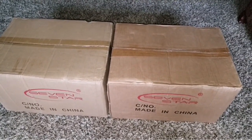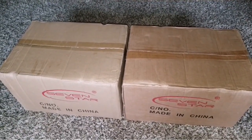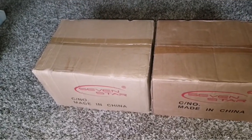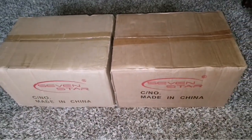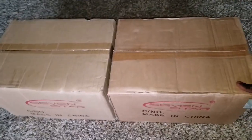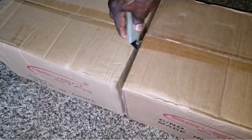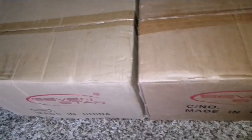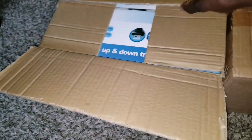Because the PIPs — we don't have any of the bigger PIPs like four or five kilowatt; they're all 2.4 kilowatt. So I had to go through MPP Solar and get the 5 kilowatt units — two of them, which is 10 kilowatts. They're already configured for parallel, so they can be a 10 kilowatt system. These transformers are 5 kilowatts each.